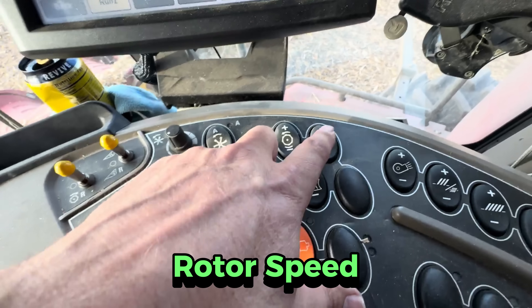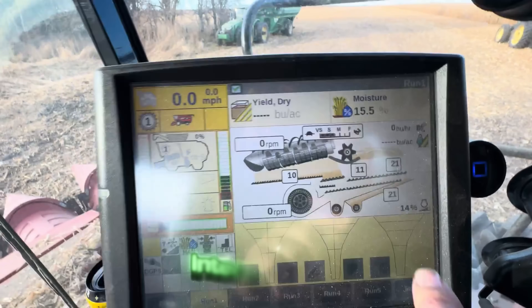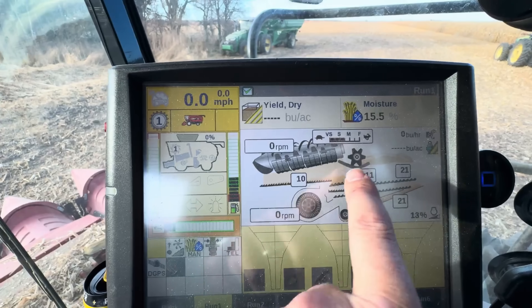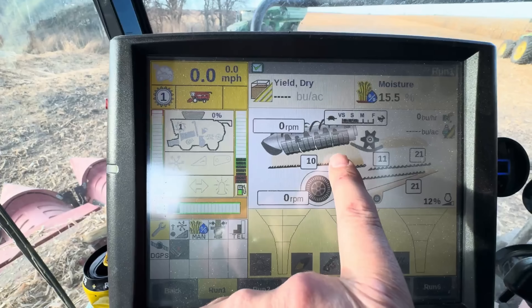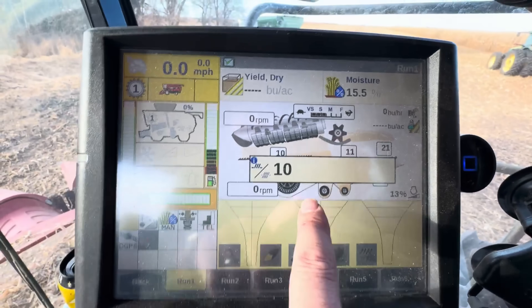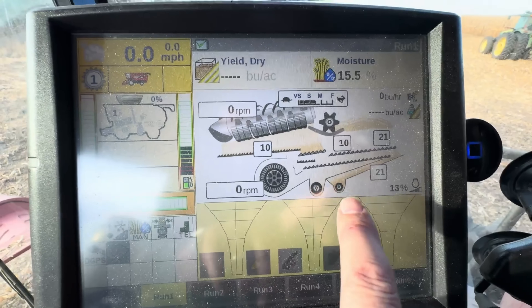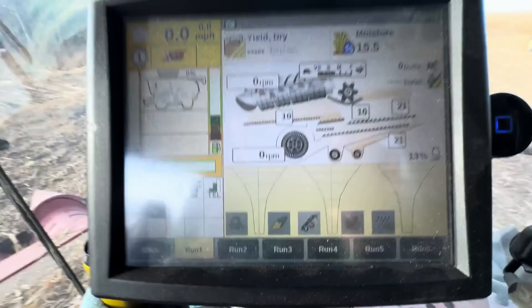Here's how you speed and slow your rotor and then adjust your rotor distance — your concave to the rotor. I should mention I have Estes Performance Series 3 concaves in this. I used to run the round bar concaves from Case, now I'm running the Estes concaves. The Case round bars are good; the Estes are great — they are better. You can see the internal flow of this combine. I have one 30-inch rotor, I think about eight feet long, then a shaker sieve — this is the pre-sieve and then the after sieve — and these open and close from inside the cab. Blower fan, then clean grain auger, and a returns elevator. Any unthreshed grain will come down into the return elevator, and that is all monitored.